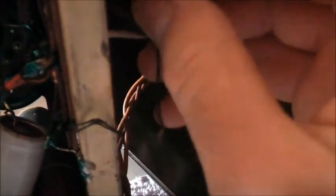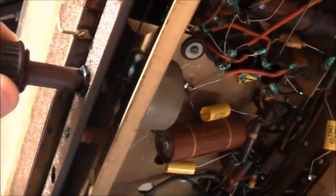So to turn the radio back on, I just unplug that. Oh, that's never had anything plugged into it by the looks of it. It's quite stiff. It's never been out, this thing. Oh, the radio's back on. That's shortwave. Yeah, that motor was causing interference. Now it's working really well.